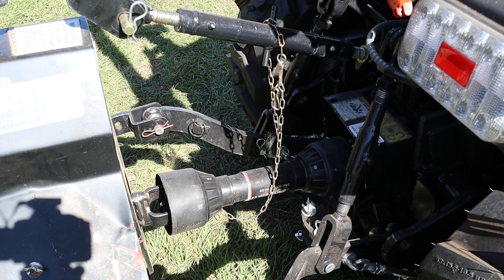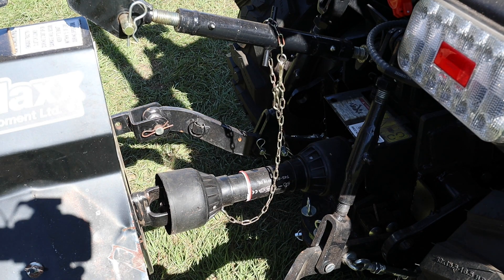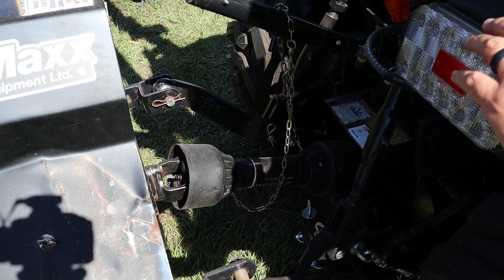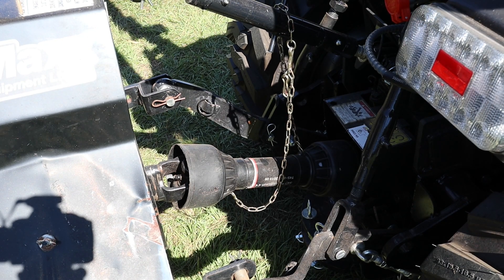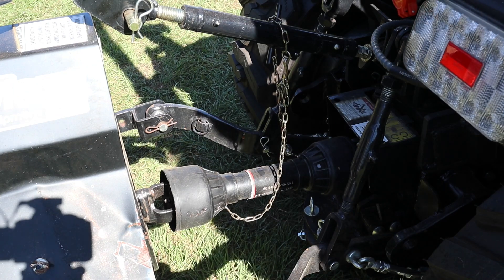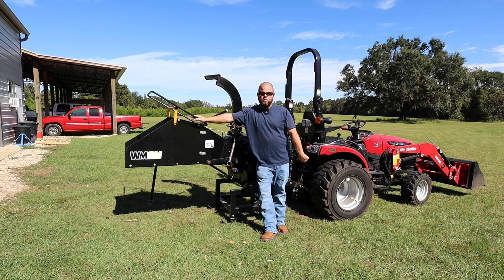I've been testing this out for a couple of days. If you look at the difference between this shaft and this shaft right here, it's about an inch and a half. As I lift up to the highest point that I can go, see the shaft go in — but I still have about three-quarters of an inch of play right there, which is sufficient. I've tried to keep this one really close because I'm also using this shaft on another tractor that needs a longer reach. But I have a nice, safe amount of play there, slipping between the two shafts without potentially damaging bearings or seals. Hopefully you learned something and enjoyed that. Coming up in the next episode, we're going to find out: can we use this large eight-inch wood chipper on a 24-horsepower tractor? Catch you on the next video.